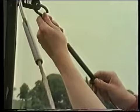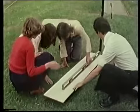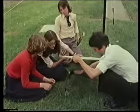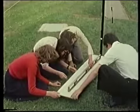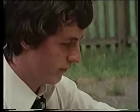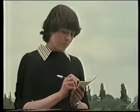A bit of adjustment to the guy ropes. And not only must the pole be vertical, but the shadow must be cast along the horizontal — hence the base plate. Again, a bit of adjustment and re-check. But we need to know the height of the pole above this base plate, and that meant measuring up to our white reference mark. That's quite 30, so the 30 had to be added to the 288 to get the total height of the pole: 318 centimetres.